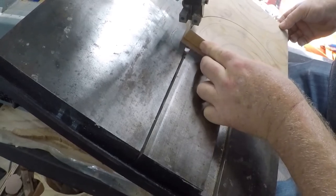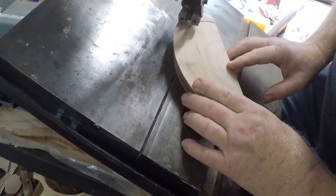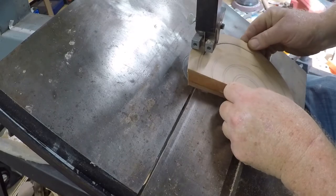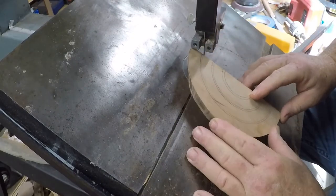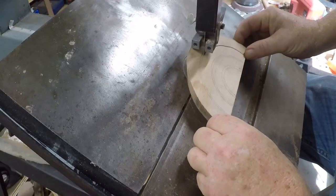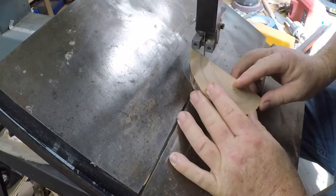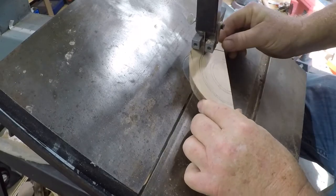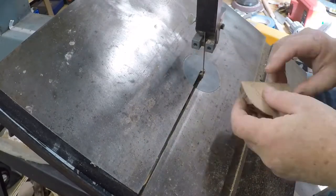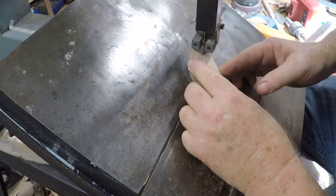I should have wrote it down. But anyway, that was probably one of my first mistakes. The lamination that I did on this bowl was not the best — there are actually gaps, and I've never laminated anything like this, never taken adhesive and put it down with weights and pressure. I only had about two-inch strips that were somewhere in the neighborhood of about a quarter of an inch after I got them milled down, which a cabinet shop helped me out with.